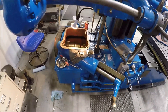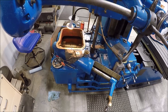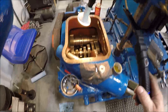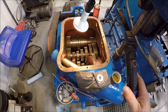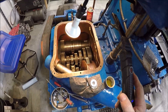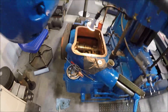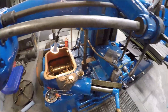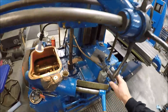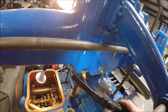I hadn't run it really a lot — we did do the angle plates and I ran it for a couple hours doing the milling on it — so hopefully I didn't do any damage in there. It probably ran hot being that it only had half a gallon of oil instead of five gallons. I've got some ISO 46 ordered.